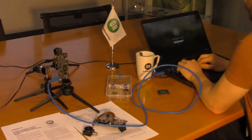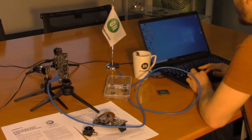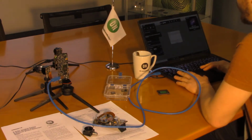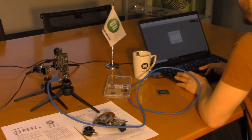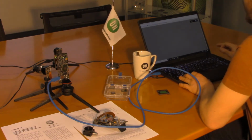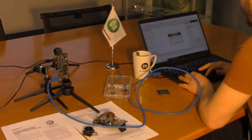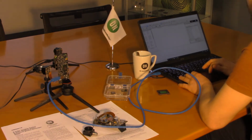Now, if you have the latest DevWare already downloaded, once the sensor has initialized, just wait a few seconds, start your DevWare, and it should recognize the sensor straight away. You'll see if you have done it right if it says that there is no frame buffer demo board attached. That's correct, because we are using the EIS adapter to connect it over MIPI to our XGS sensor. Just press OK, and as you can see, it has recognized the sensor. It's an XGS 16000. That's correct. Here it shows the setup wizard, and we can just press finish. And after a few moments, after it has uploaded our required registers to the sensor, it will start streaming.